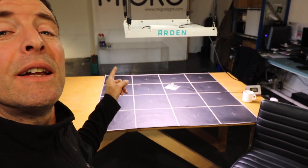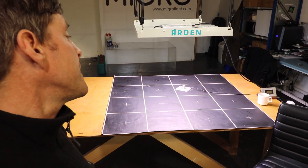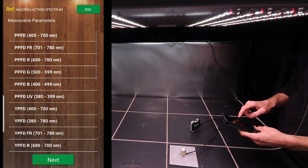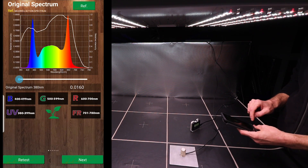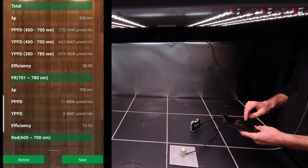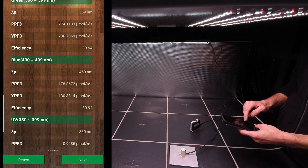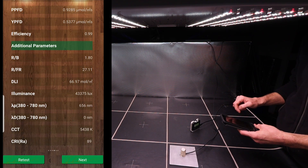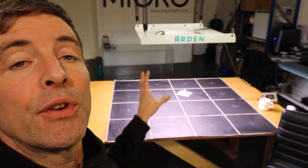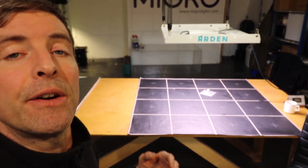Despite the high hanging height, the light intensity underneath and the coverage is excellent. The uniformity is very good across a 4x4. We put it into the test area with the silver mylar walls and tested first for spectrum. The white LEDs appear to be 6K — a very cool white color temperature — and mixed with the 660 nanometer reds it produces just over 5500K, which is a bit more blue than I'd consider necessary, but that's Samsung's spectrum. It will certainly be suitable for growing from seed to flower — a full harvest, full spectrum.